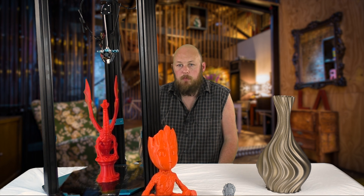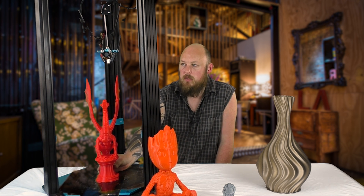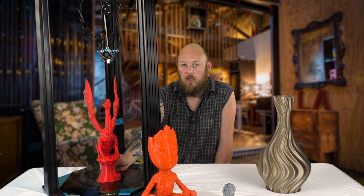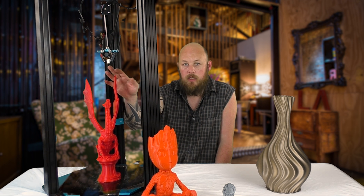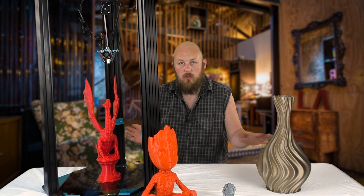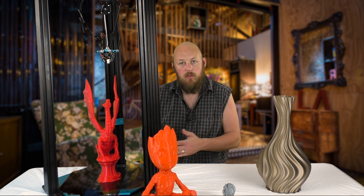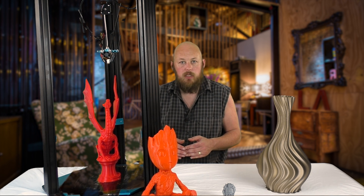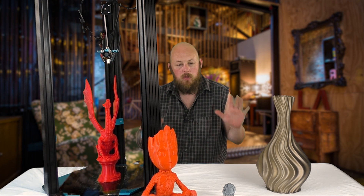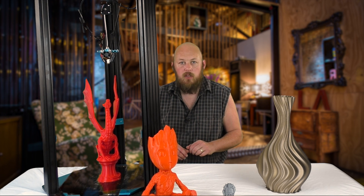You can see by some of these prints here, I've done some rather large ones — this one is nearly at the biggest of the print size. I'll put links to these prints in the description. These are printed at 0.4mm layer and I've actually swapped out the Volcano nozzle for an 0.8mm just to give me the fastest speed. I'll put close ups of all of these prints at the end of the video and links to ones I've already done via live stream or uploaded.